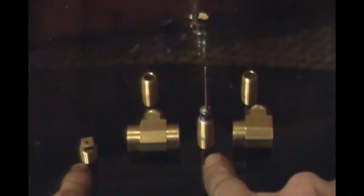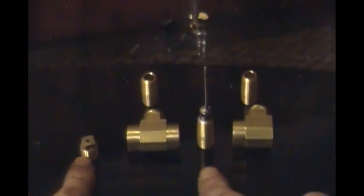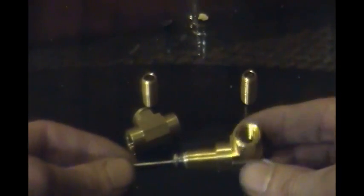You can see the two pieces we've modified recently — here's the plug with the hole in the end. I've also taken the liberty of shaving down the top of the plug so that it's a little bit shorter in this dimension. And here's the modified pipe nipple slash ball nozzle assembly — the nozzle soldered into the nipple. We'll assemble this by constructing our fuel line first. The modified piece goes into the elbow like this. In the final assembly I'll be using Teflon tape to seal all the threads, but this is just for demonstration purposes. So that's one segment of our fuel line put together, and here's the second — a close nipple here and another close nipple here. So there's our fuel line.